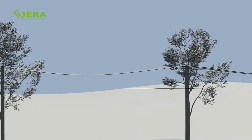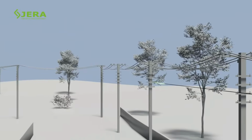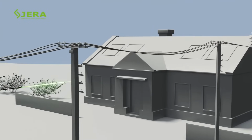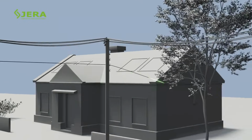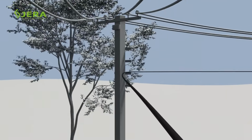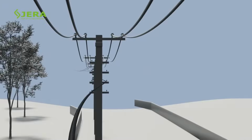The drop wire fiber optic cable was developed to connect the end user and optical network terminal for deployment of outdoor fiber cable networks. The drop cable is installed overhead via the poles by cable clamps with indicated tensile performance.